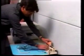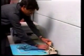The ground wire in a modern building will probably be all right, but you can check it with a ground checker. The wrist straps have to touch the skin, or they don't do any good. If the worker can't wear a wrist strap because it hampers movement, he can wear heel straps, which go from the moist inside of his shoe to ground by passing under the heel. Of course, he must be standing on a floor pad that's both conductive and grounded.